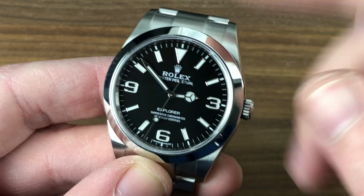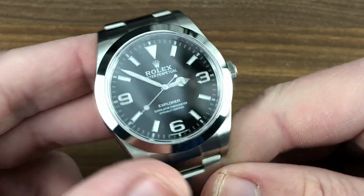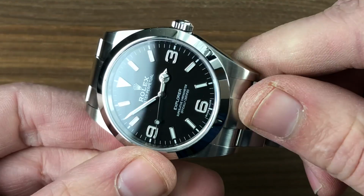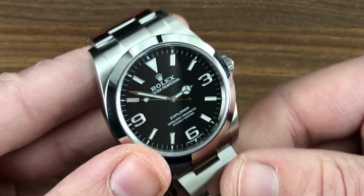Now the 48-hour power reserve beats away on a free sprung balance with a full balance bridge for shock resistance, and there is a blue oxidized niobium zirconium hairspring that is anti-magnetic, Parachrome blue they call it. It is also a handmade Breguet overcoil that allows the watch to keep excellent time in any orientation with respect to gravity and earn its chronometer certification. Tough, timeless, and very precise.